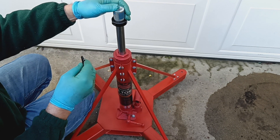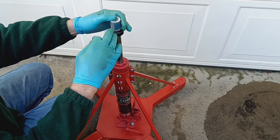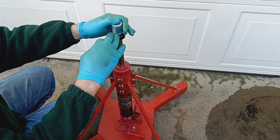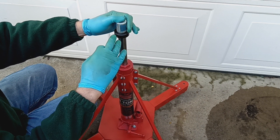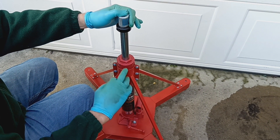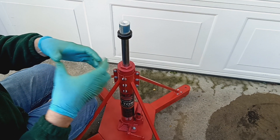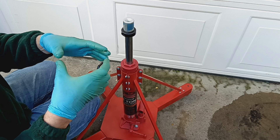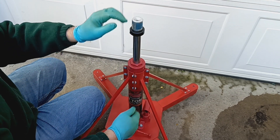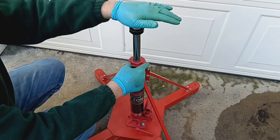The reason I didn't see this when I first started using the jack is I didn't have this safety collar. There was no circumstance where the aircraft load was on the jack and then removed while the aircraft was still elevated. But with the safety collar, if the valve or seal were leaking slightly and the cylinder crept down to put the load on the collar, then that cup seal would no longer be energized — no longer flared out against the inner bore. When you then went to pump it, the fluid would just bypass the seal because the aircraft may have shifted slightly and put a side load on the ram.